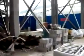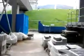Here we have one of our winches, which we're not using at the moment. You can see down there in the corner the winch, which we bolted to the ground with expansion bolts, and it goes up to that cat head there, which is a scaffold structure we put up to winch things up to the gantry. And if you look up here, you can see the roller coaster like Alimac track that leads up the stack with all the scaffold in place that holds it to the stack. That was a new experience for us. A couple of colleagues went on a course to learn how to assemble it, and we worked along with the guy who sold us the Alimac to put it in place.